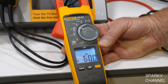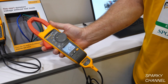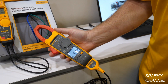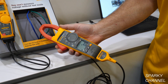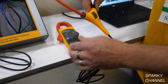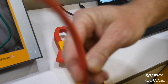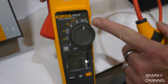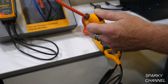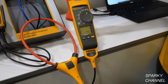It's a great tool to have when you're out in the field. Is there an advantage to measuring with the iFlex? The iFlex is important because a lot of times we might have trouble getting our jaw into a tight spot. Out in the field they don't make it easy to make an amperage measurement. With the iFlex we can turn it over to that mode — it's flexible. We go ahead and put it in the iFlex mode and then incorporate the flex itself, and you can see the measurement.